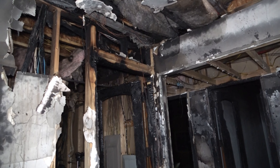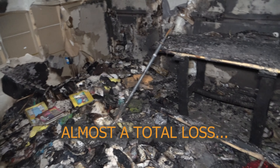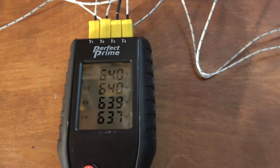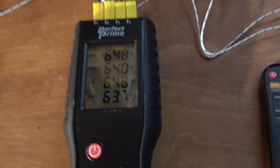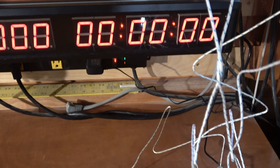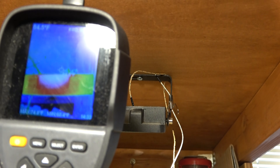Tip number four: make sure you check the heat of your lights so you don't catch anything on fire in your shop. Fires are a terrible thing and we're probably underinsured most of the time on workshops. I put four sensors on this light assembly — number one, number two, number three dangling over the top, and number four touching the wood up there. Right now they're all at room temperature. Let's start the stopwatch and see how hot these get. Just a couple of minutes in, you can already see the back is heating up.